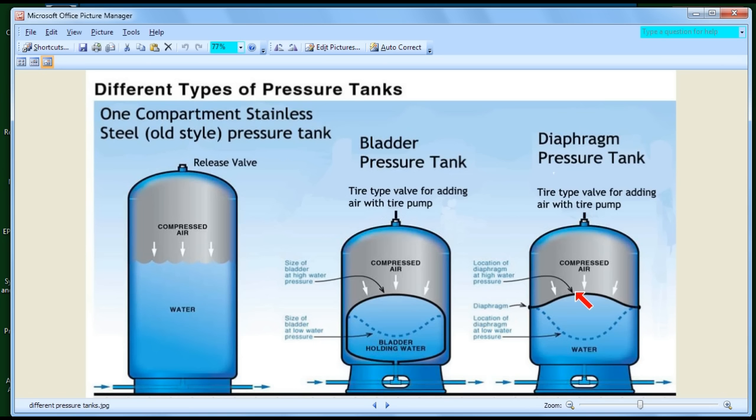You might say that's bad. But the point is that the diaphragm tank is usually made at higher quality and is more expensive than the bladder tank, whereas the bladder tank is made at lower quality and if the bladder breaks, you just replace it. The diaphragm is sealed at manufacture — pressed in very tight. The rubber diaphragm goes across the tank and is very thick, supposed to last for many years. But if something does go wrong, there's absolutely nothing you can do except throw out the tank.